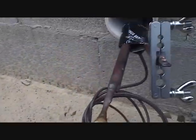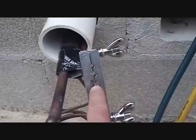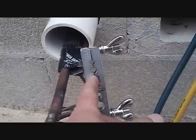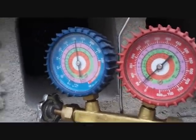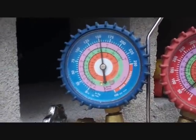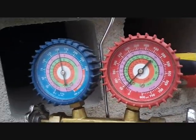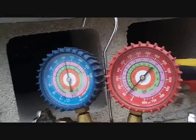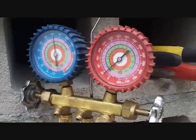I'm going to get brazing. All right, I've finished brazing. I'm adding nitrogen to the system to pressure check it. I cut some holes in there so I could exhaust the air when I was flowing nitrogen, so I've got the crimp-off tool on it just to make sure it's shut. 150 pounds of nitrogen was suggested by the manufacturer, so that's what we're going to use — usually I use more, but for this case we'll stick with that. I had a suspicion I might have a leak because I had a difficult-to-reach area, but so far so good.